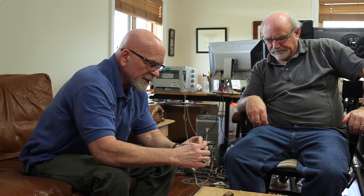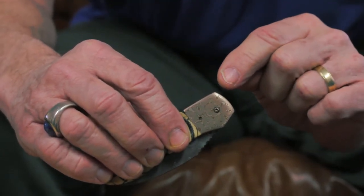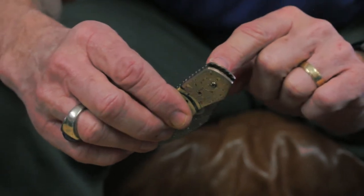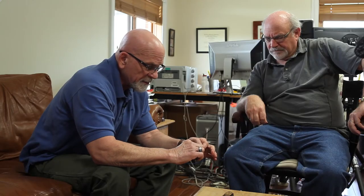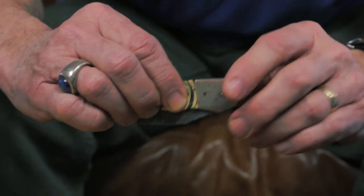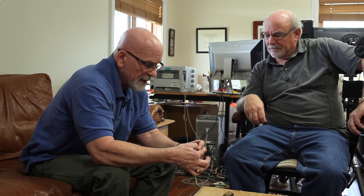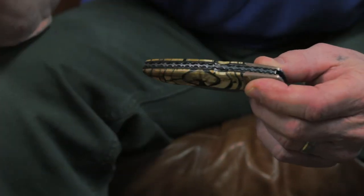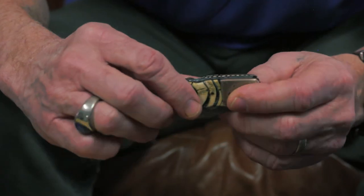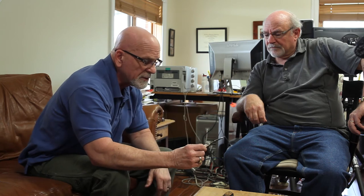This is what I would call a mid-release. All automatics work on a principle of a lock bar with a little tooth on the end that fits into a groove when it's open and fits into a groove when it's closed. There's a coil spring in here that's countersunk between the frame and the bolster on this side and the knife on this side. There is what I would call a tempered spring in the closed position, and when you press down on this small indentation it releases the knife and the coil spring springs into action.